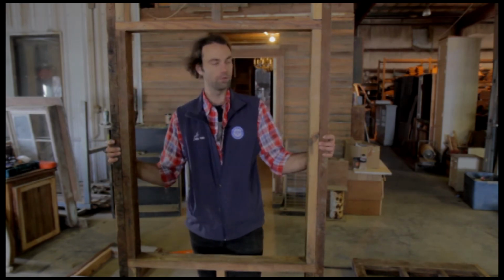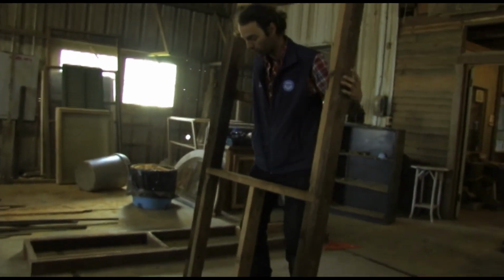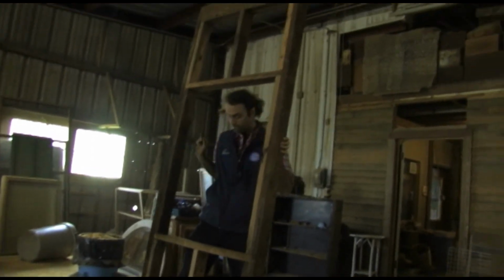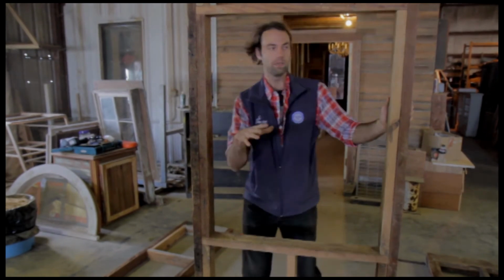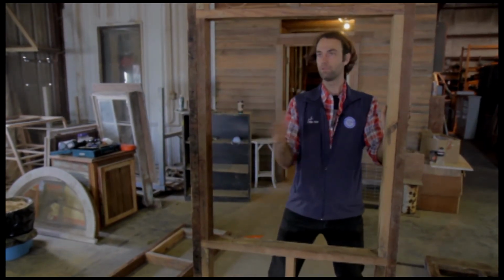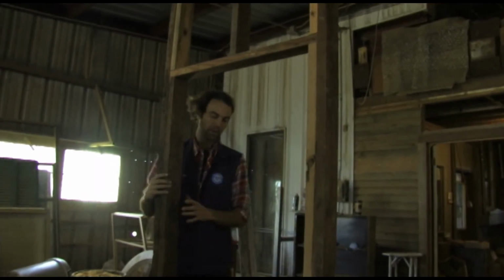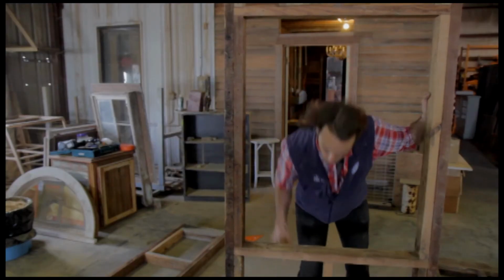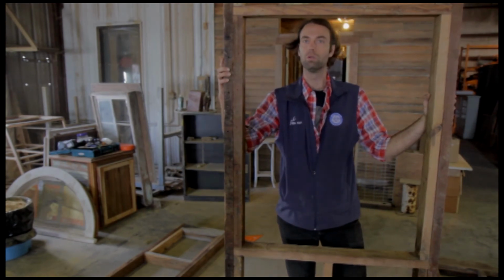And then this also gives the advantage that I was talking about when we were in SketchUp. When we attach this to the wall, we're only going to attach it using 2 screws here and 2 screws up at the top. So we can tilt the wall up, we'll get all 4 of our walls up, and then if we, for some reason, decide that one window is not quite in the right place or we like it a few inches over, all we need to do is unscrew these 4 screws, and then we can literally just slide it down almost like it's in a track, and then re-screw it in the 4 places. So that's a really cool feature.